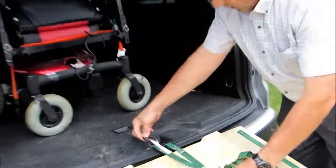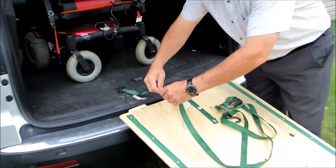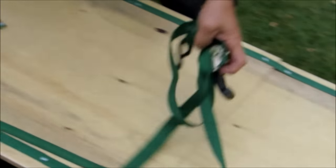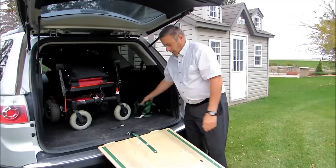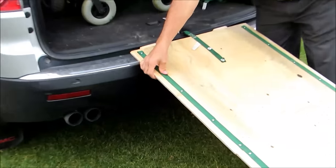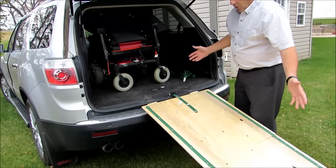What I did here is I cut this piece off and screwed it on over here so you can hook it into this door latch. The rest I used here — it works as a hinge and it's flexible so you can fold it up nicely and it doesn't interfere with anything. You need to buy two of them so you have one for each side. Get screws that are half-inch if you have half-inch plywood, so they don't stick through. If they stick through, you may have to grind them down.